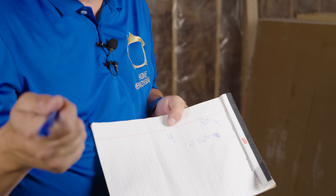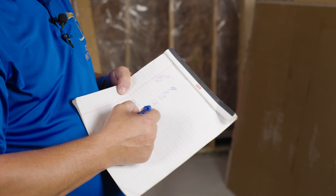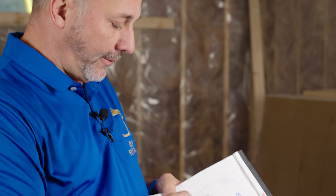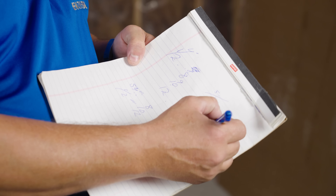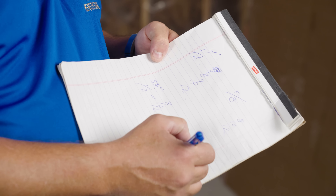But the truth is there are more options, and I'll tell you in this video where to go shopping so you can get all of them. 54-inch drywall comes in 8s, 10s, and 12s as well. Some regions, the boards go even up to 16 feet long — we don't have that here in Ontario, but drywallers have commented that you can get really, really long sheets, though they can get super heavy. And that's still only the half-inch thick. You have the same options in five-eighths: 8, 10, and 12, and the 54-inch in five-eighths as well.